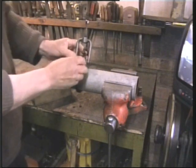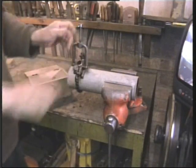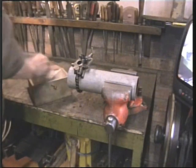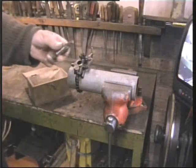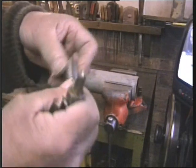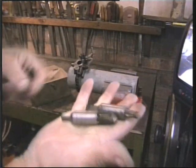That's it. And we position it where we want, and then we tighten it up. Right, that's positioned the tool on our pipe. And then we have numerous various sizes of drill. And the drill incorporates the thread. And it incorporates a 1/2 inch shank at the opposite end. And there's all different sizes.